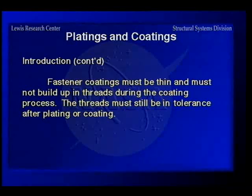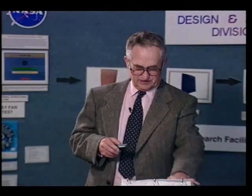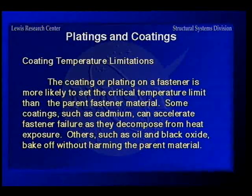Cadmium plating is used for electro-depositing alloy steel up to 190 KSI strength. Above 190 KSI you cannot prevent hydrogen embrittlement with standard cadmium plating and must use vacuum deposition, which is much more expensive. Parts must be baked within two hours after plating — the bake time ranges from 8 to 23 hours depending on the process. In some cases no baking at all is done, which is a serious problem. During electroplating in an aqueous environment, free hydrogen ions are generated and can penetrate the material — so baking immediately after plating is critical.